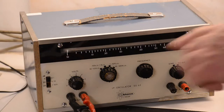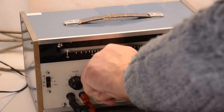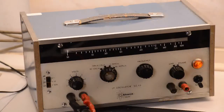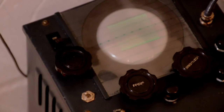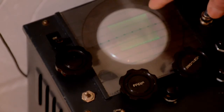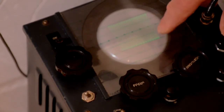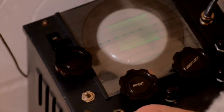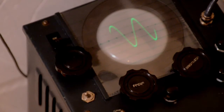Let's now change it from one kilohertz to 10 kilohertz and look at what the frequency response is once again on the oscilloscope. Here we have the scope showing 10 kilohertz — it's still about four divisions, which means we have a pretty flat frequency response between 100 hertz and 10 kilohertz. That's the sine wave going at 10 kilohertz through our amplifier.